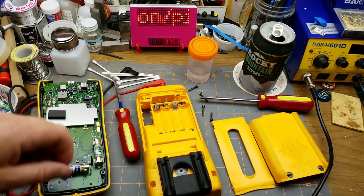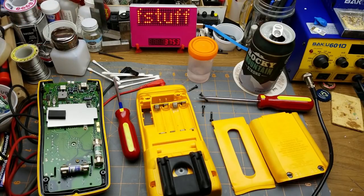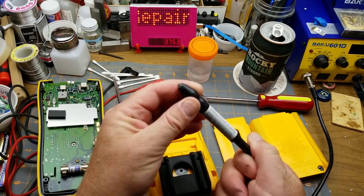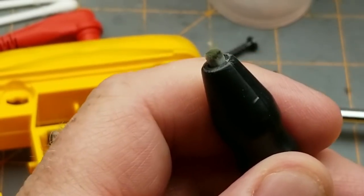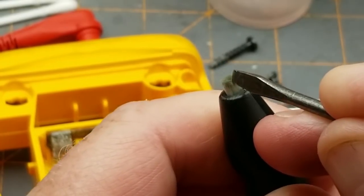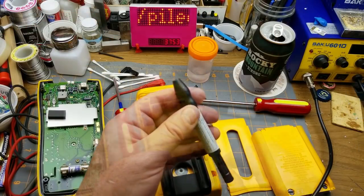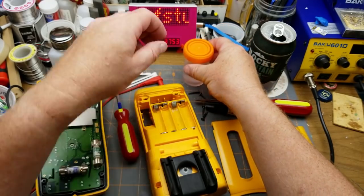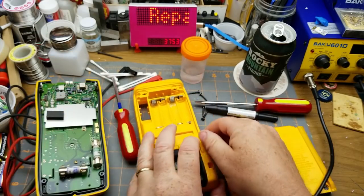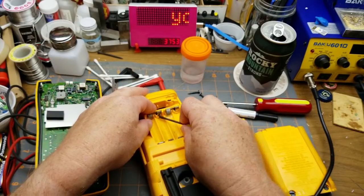I've got some cotton swabs — North Americans call them Q-tips, Europeans call them cotton buds or earbuds. I'll use those for chemical cleaning, and also do some mechanical cleaning using this old RadioShack sanding pen. What it actually is is a clump of fiberglass bristles — if you only expose just a little bit it makes for a fairly decent abrasive. Since it's dried and not liquid anymore, I don't think I need to neutralize it — I probably just need to clean it.